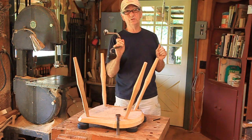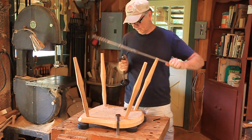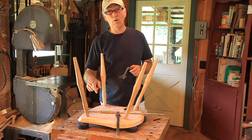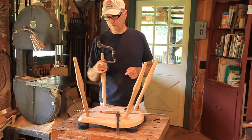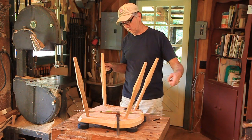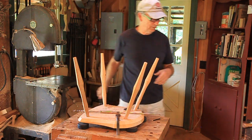This is my favorite bit brace — Jenny Alexander gave it to me in 1986 and I've drilled almost every hole in every chair with it. But it's an 8 inch swing, and driving this 5/8 inch auger bit into this red oak requires a lot of power. I usually go to a larger swing bit brace — the increase in power is, I guess, exponential. You saw I struggled a little bit with that hole, so I either need to be stronger or I need a bigger swing. Since I can't be stronger, I'll get a bigger swing bit brace.